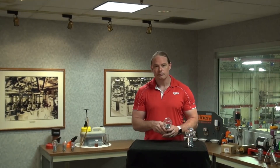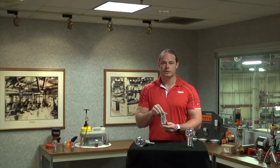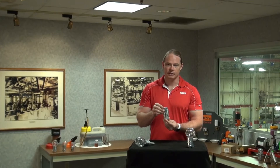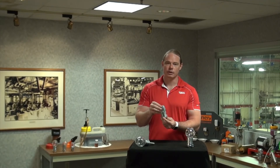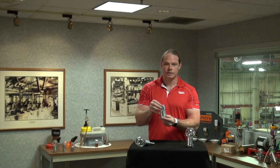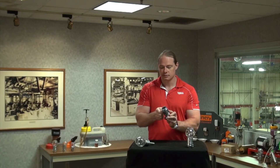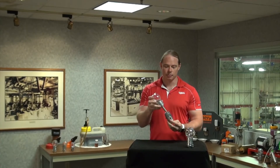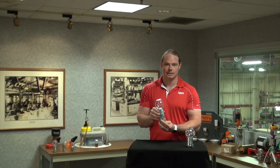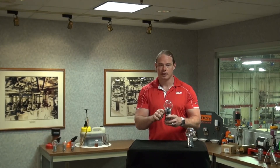To set the closed system, take the upper bottle reservoir apart and you'll notice on the lower reservoir assembly there is a sliding sleeve. This allows you to set the oil level at the bottom level of this sleeve, so adjust it to the point at which you would like it. Tighten the hex or allen screws on the side. Re-apply the upper bottle assembly until the casting sits securely against that lower sleeve, then tighten the knurled thumb knob on the bottom.